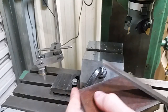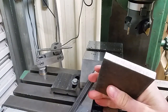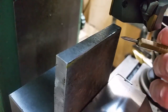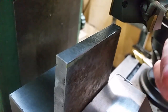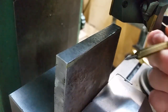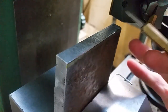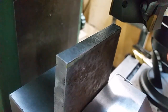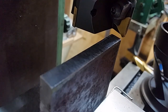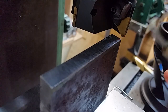When you're machining it's always a good idea to deburr — it really helps take the edge off. The finish is very rough, so to get a good finish, contrary to what I was saying before, we now actually want to offset the cutter so it cuts right on the edge of the part. This puts a longitudinal force on the plate which is dangerous, but because we're just taking a light finishing pass it should be safe. The ideal position for the cutter is perfectly tangent on this edge.